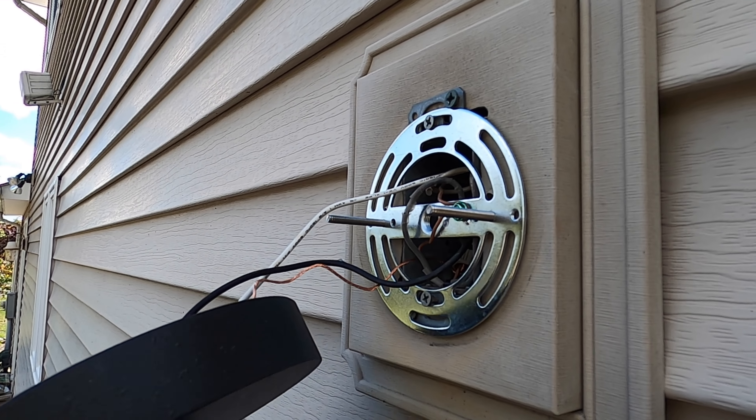I hold the fixture — or you can have someone hold it for you. This is a solid conductor. You don't want to start the ground wire even with the end, because when you put on the wire nut, this stranded conductor is going to get pushed down. So when you make a solid-to-stranded connection, you want the stranded wire a little farther past the solid conductor. Then you put your wire nut on and the ground wire will not move — you're sure it'll be in there solidly.